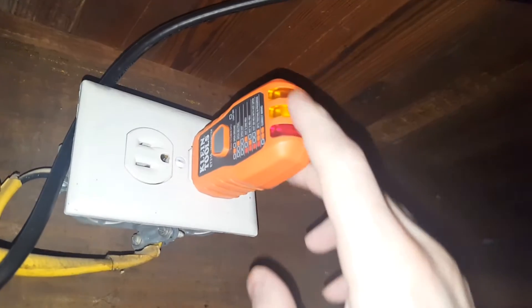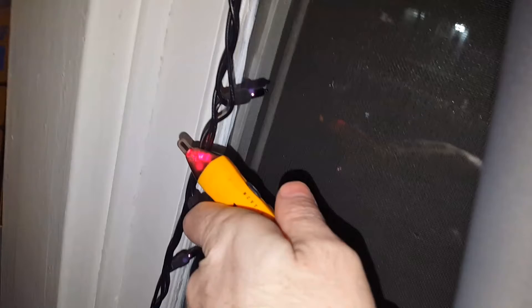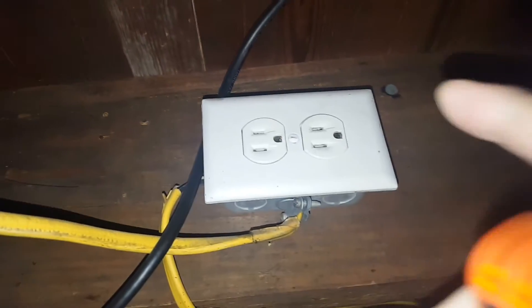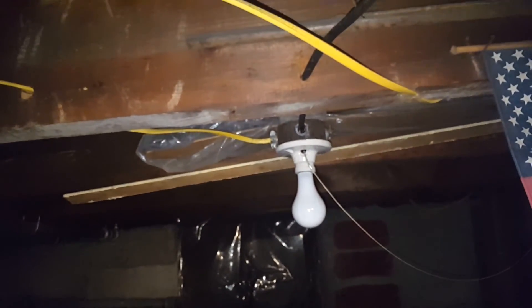Unfortunately this will turn off the entire basement in my particular situation, but I know which circuit this is on. I'll flip this off and see that this is not lit at all — that tells me this circuit is off. I'll also use a non-contact voltage tester to make sure there's no voltage coming through at all. Then I can get a headlamp, take this off, and see why it doesn't have a ground, or add a new outlet or light fixture. That's about it — I recommend checking out this tool, there's a link in the description. Thanks for watching, I'll see you next time.